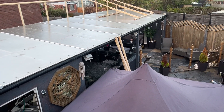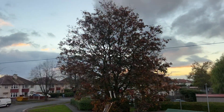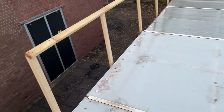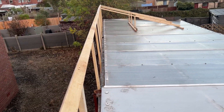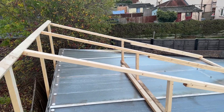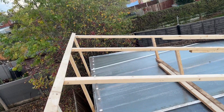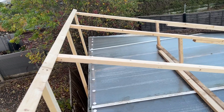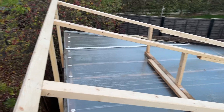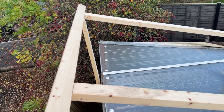So that's the progress we've got today - going to put more beams up across there. You'll see the weather's changed now - the clouds have all disappeared. So we've got like a handrail at the minute - you can walk across there, nice and solid. Just watch where I'm standing - it's polycarbonate on this roof. So I'm standing on these beams that are going across. So I'm putting it on an angle - 31.5 degrees, coming down there. I don't want the snow staying on top. The snow will probably still stay on top anyway, but I'm going to get a scraper to pull it down when it's snowing. In our climate now we don't get much snow at all - it's only around March, April time that's when we usually get ours.